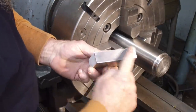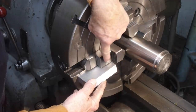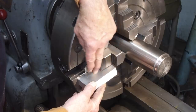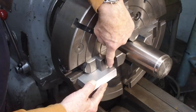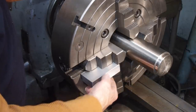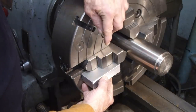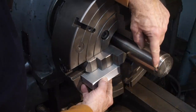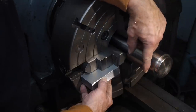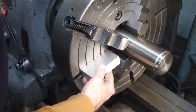Over at the lathe, we need to decide whether to skim this side or just plan around it. The jaw height here is the main concern because that diameter side to side puts us out into this area. We'll skim a clean dress off here and create a step or clearance for that outside casting to catch the inner lip. From there, we'll machine the diameter on the end of this rod, making sure we don't exceed that depth, so the hub can rest properly onto our soft parallels.